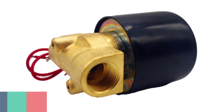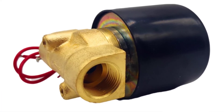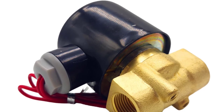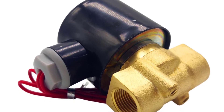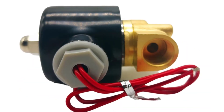Number 2. Liadu 2W025 Solenoid Valve. The Liadu 2W025 solenoid valve is normally closed. It is suitable for water, oil, helium gas, and other media. It features a brass body with NBR/PTFE seat seal. The solenoid uses solid-state electronics which will not burn out or have arcing or sparking. The waterproof plastic box makes it easy to install and remove.